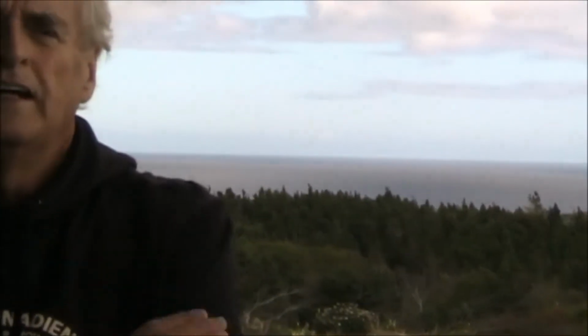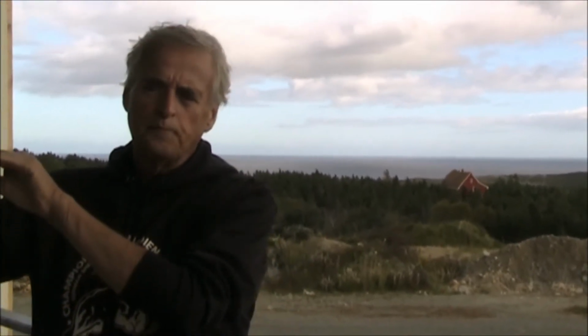Hello again, my name is Jack Parsons with K&P Contracting, and we've been talking a little bit about, as we were building this house, and it's open to the North Atlantic. One of the things that K&P does in this type of situation is use tie-down clips, and we're going to show you in a minute where we use them to connect the main floor of the house to the foundation, and also where we look to do the roof to the walls.